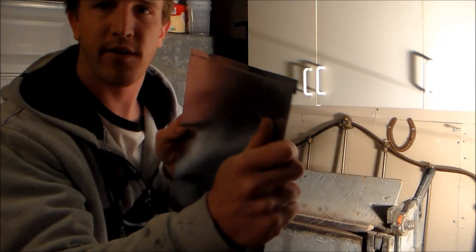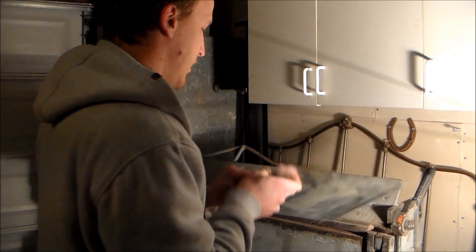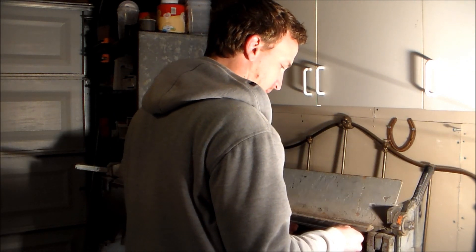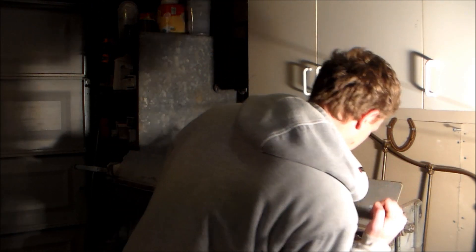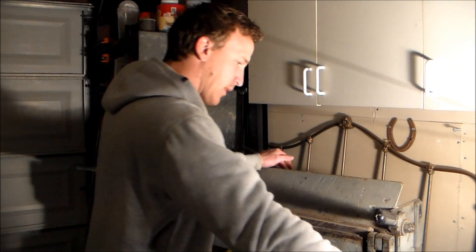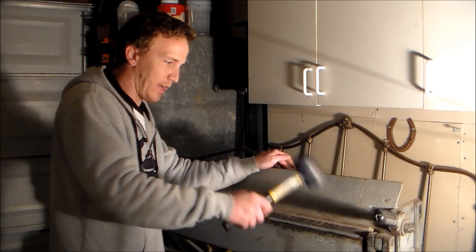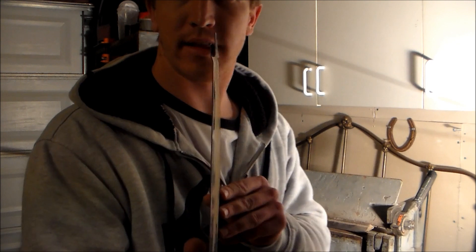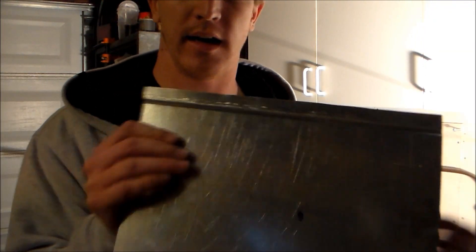Now we have part of our Pittsburgh — you can see that. What I like to do on top of that is flip it back over and clamp it right at three-eighths of an inch, where my fold is, and smash it right back into the brake. What that does is it kicks it back out, and I'm just going to hit it level to get the kick right back down. If you've ever seen a piece of metal that's gone through a Pittsburgh, this looks darn near exactly like it — it has a little kick in there so you're offset back into your metal. You've got this side and you're ready to roll.